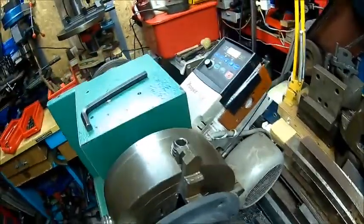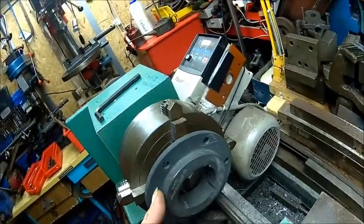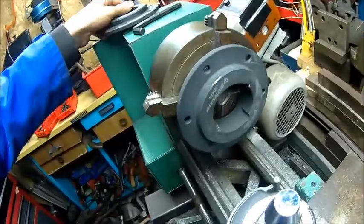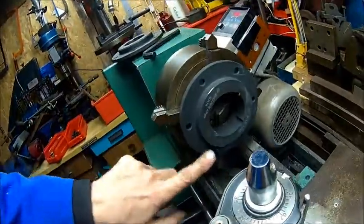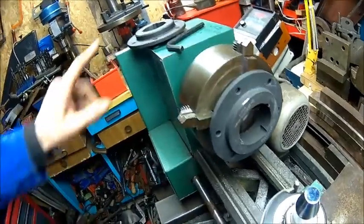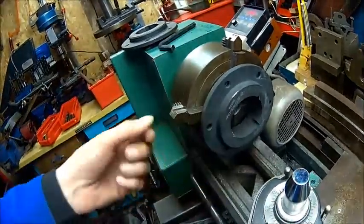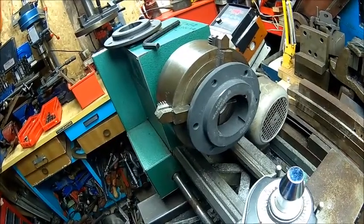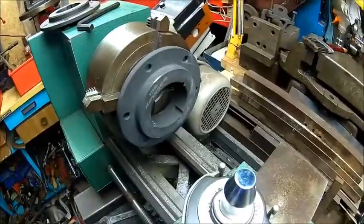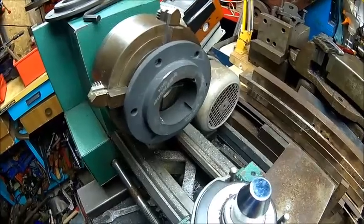just to make enough room for the bolts so they clear here, and then we drill the holes just 15 degrees offset from the other ones, put M6 studs in and then wedge the pulley in between. That was always my preferred idea. That's how we do it. So let's dial that in